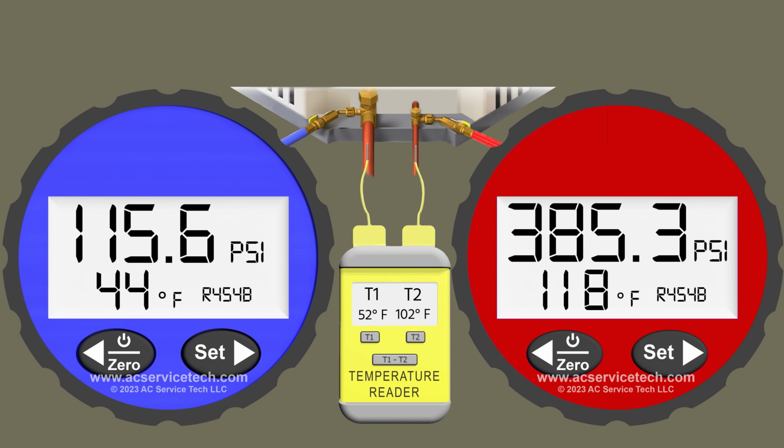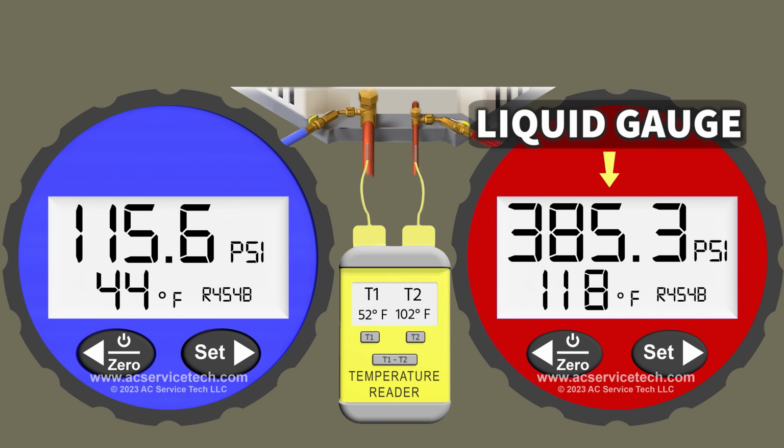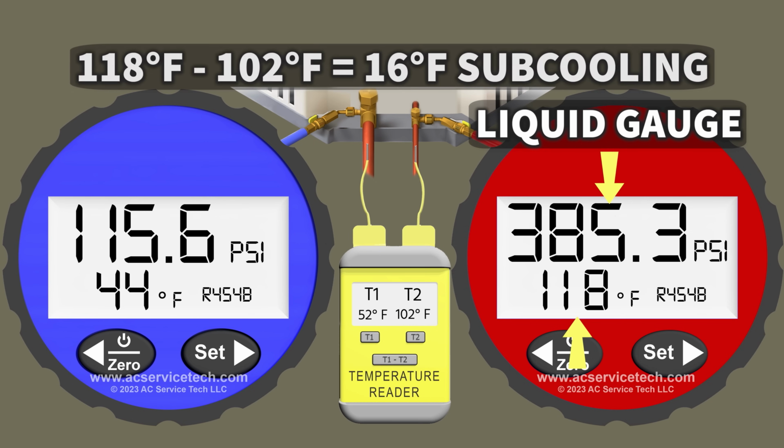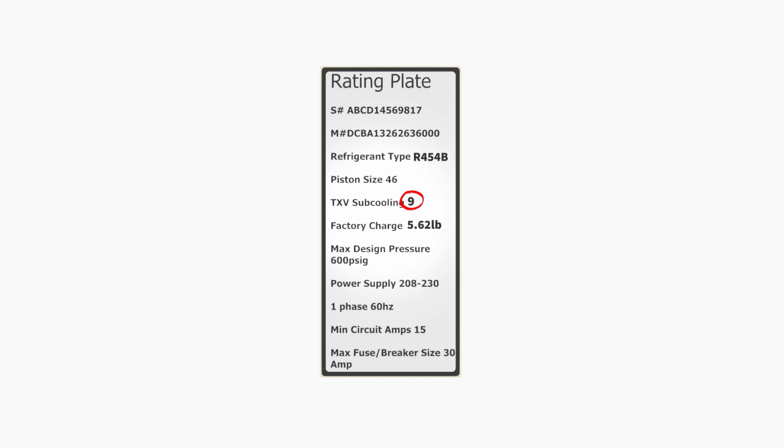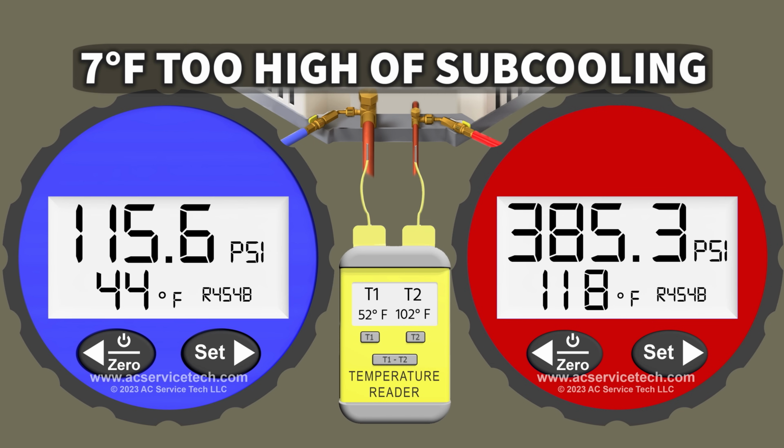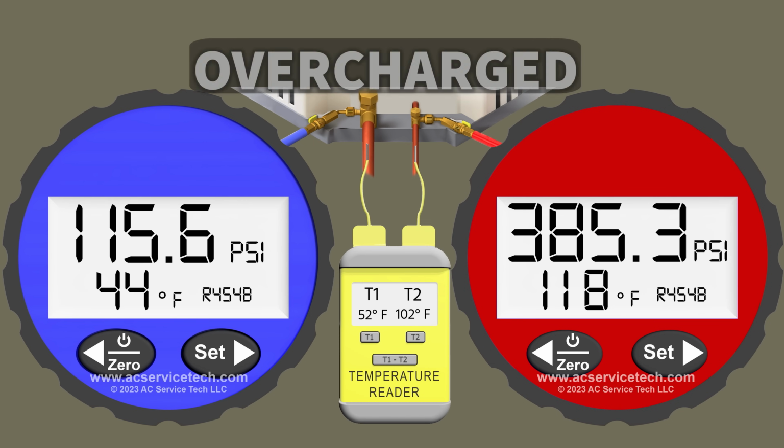So in order to figure this out, we take the liquid line pressure, convert it to saturated temperature, and we have 118 degrees as a saturated temperature. We take 118 minus 102 degrees liquid line temperature. So we're left with 16 degrees of actual subcooling. So that's kind of high. Now our target subcooling posted on the rating plate or posted on the underside of the shroud is going to be 9 degrees as our target subcooling. So we are actually 7 degrees too high of subcooling, and that means that we're overcharged.